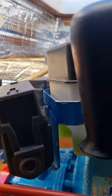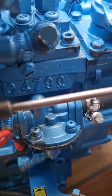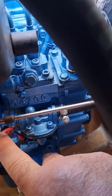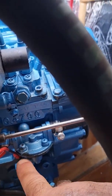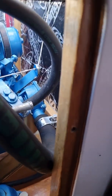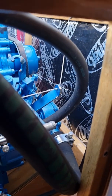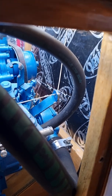There's a battery switch and voltage sensitive relay, which is part of the charging system. With this hatch removed, we've got good access around the engine to the engine beds and the engine mounts — they do need to be adjusted from time to time. We've got the dipstick here for the engine oil level. To bleed the engine, that's done from here, and at the front of the engine you can just see where this hose goes into the water pump. To adjust the impeller, you can see that from here.